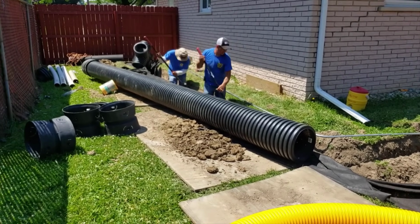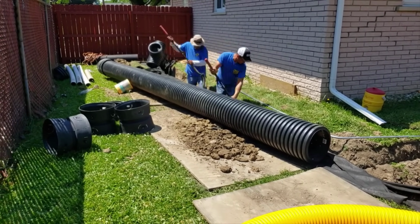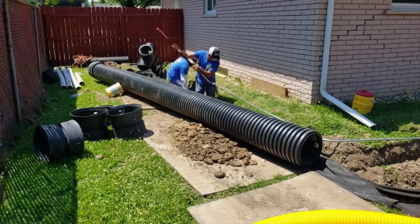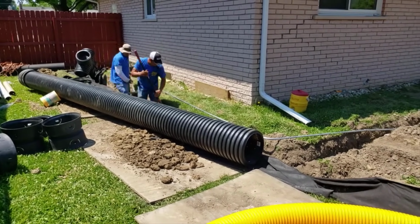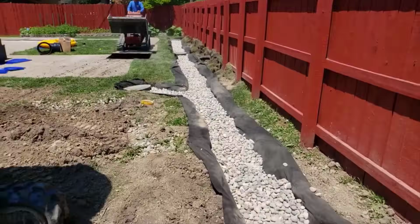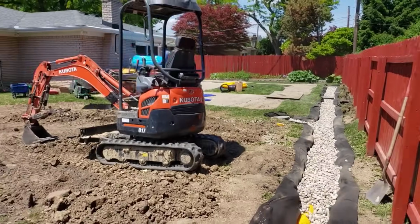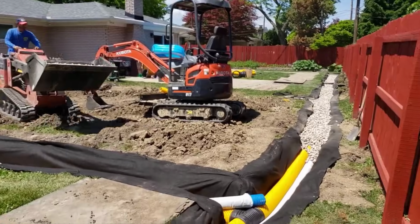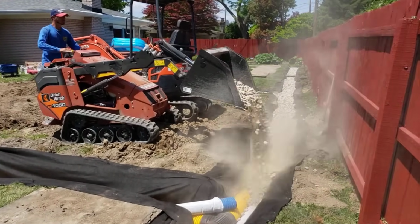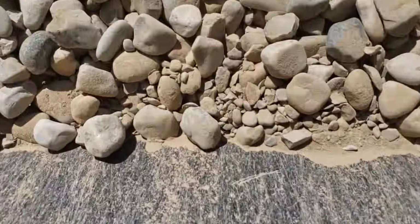So right now we're digging a sump. We're making the sump part of it deeper than the rest of the chamber. And yes, we're going to connect the piece to where dirt from the yard drain can just fall in that sump. Now, the homeowner can very responsibly take his shop vac, go around, and suck out all those catch basins.